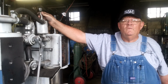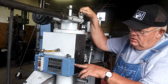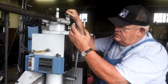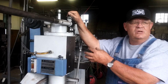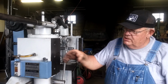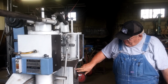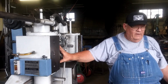How about a few words about the oiler? The use of the oiler and what's the appropriate adjustment? It's a very simple oiling system. Hole drilled into the pump cylinder. It has a ball in there that seats so that it can only go one way. As the piston creates vacuum, it sucks air through this adjustment valve. The oil comes in on the cylinders. It's spread throughout the surface, and the air atomizes the oil and puts it into a mist, and then the oil is transferred to the ram through the pressure and the air that's moving in there. It's just a mist of oil. If you can get a smear of oil on your finger on this ram, you're getting enough oil, because it's the last place. So if we have oil here, you can be satisfied this is oily.